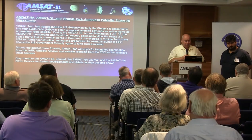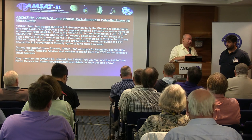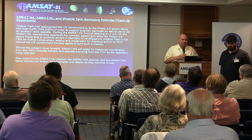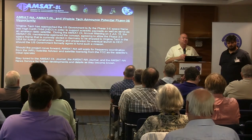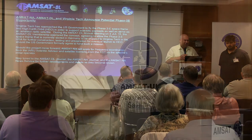There are several components which we can reuse. For example, we have some high power modules, we have command receivers, things like that. There is not much change. This is a very robust design. I think we may reuse part of it. The onboard computer, the IHU, is a very old design. Its components are even no longer available, so a new design for the IHU will be necessary, and a few other components. But most of the stuff, in particular the mechanical stuff, is there, and this is the most important part.